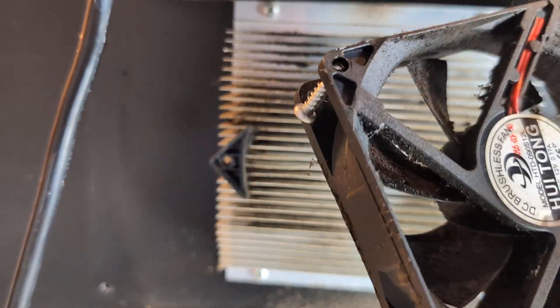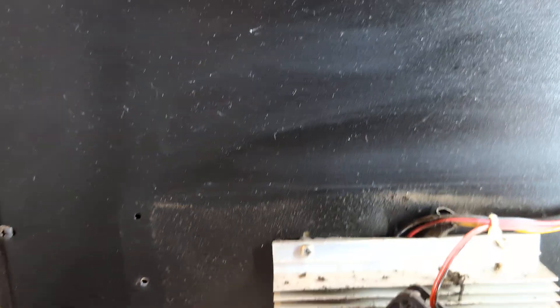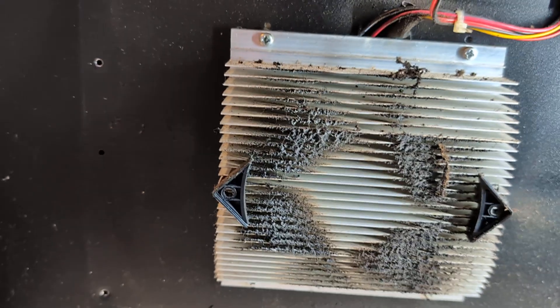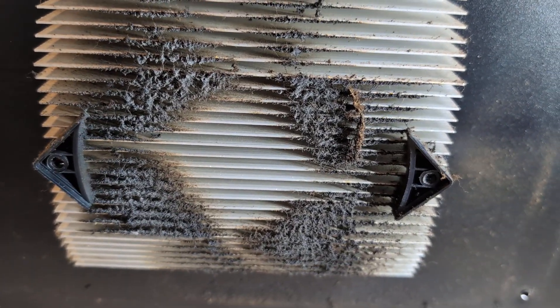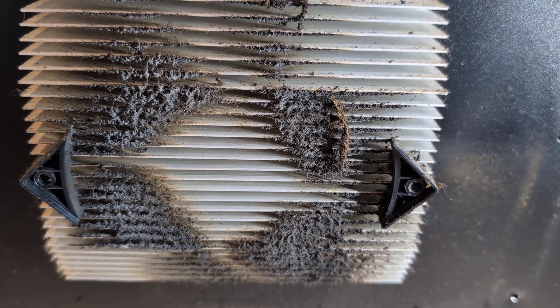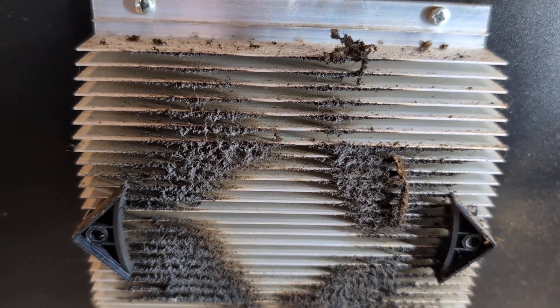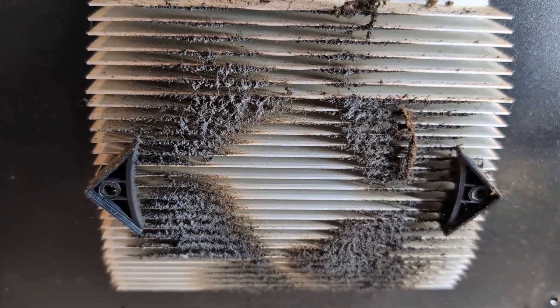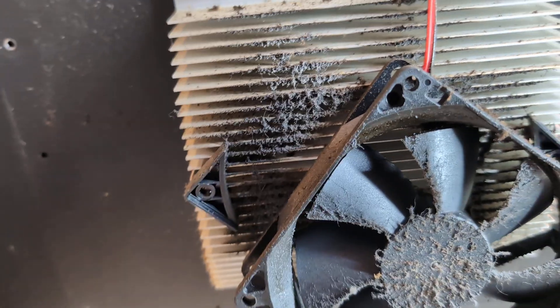What I discovered was that the coils were extremely dirty, and this affects their efficiency. The good news is that because it's reaching the high 60s, we know the system is working. This dirt could easily explain why it works so inefficiently. So I think if we remove all the dirt from the coils and remove as much dirt as we can, we should see improvement.